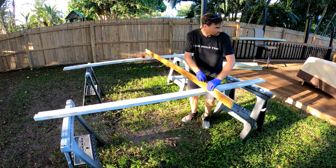Put your spacer block in, tap it down nice and level, put your clamp in as shown, then grab your level and spacer block and move over to the opposite side to make sure this is as level as possible. It's very important to get this first row spaced properly and level because this is what sets the next row above it at the right height, and also the rows left and right if you're adding more than an eight-foot span. So take your time, tap it into place, and make sure it's all good to go.